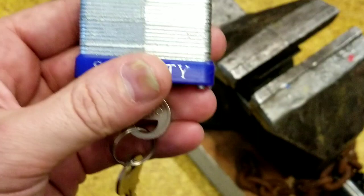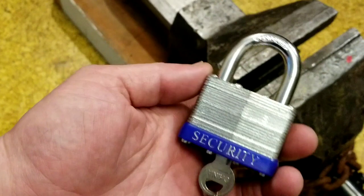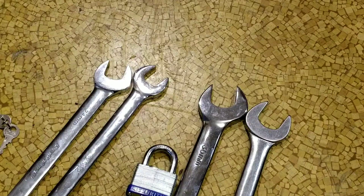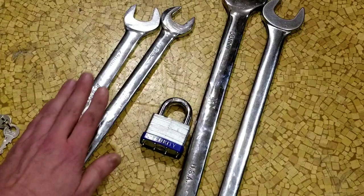You can see how the shackle is all canted over — that was my biggest issue. The rivets just aren't that tough, which is what you expect for a three-dollar lock. I've tried this on Master Locks and beat them hard and never had the laminations shift like this. I'm going to straighten these out and do the two-wrench test too. The most recent Lock Picking Lawyer video breaking this lock didn't go into much detail, but one thing about going sideways versus vertically is you can use much larger wrenches vertically — something they fail to mention.